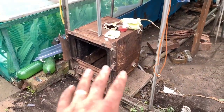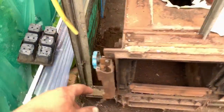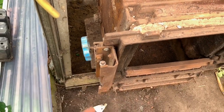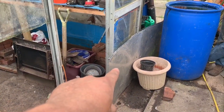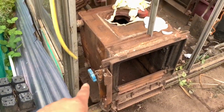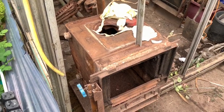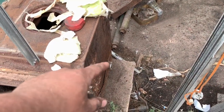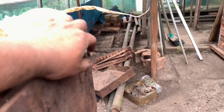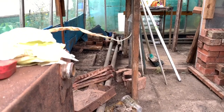So far, I'll spin you around. I've just sorted one of the onions out, I'll tell you about that in a minute. But I managed to get the fire in place, the top resealed in, the door pinned back in place, drilled and pinned. So we've got the first glass in, top sections in. The next step would be to cut this metal to size and put it around that side, and then that's sorted. The reason why we've pushed it right across this side and it's not central is because the pipe work's going to be on this side, and the pipe work's going to need a 90 degree bend on here, so that it goes all the way up the top there. So that's exactly what I'll be ordering when I get home.